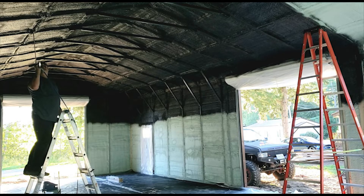I had three 10-by-10 doors plus a man door wide open while I was doing this, and ventilation didn't seem like it was a concern for me. But the paint got everywhere. I laid down plastic all over the floor — thank God — because it got so bad that the ladders were sliding around on the plastic. You've got to remember you're spraying overhead so it's raining down all this overspray, which is not good, but it is what it is. It's done.